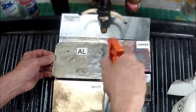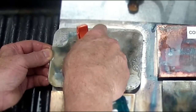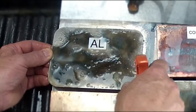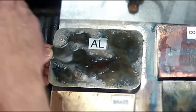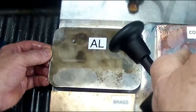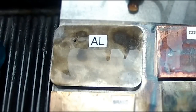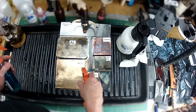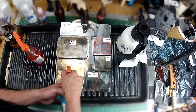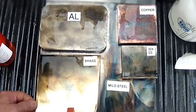What you see bubbling there is pretty unusual because the activator is not that acidic. What you're seeing is a release of hydrogen gas, and even though it's odorless, it's not safe. I wouldn't recommend using the activator on aluminum unless you've got a fume hood or you're working outside with a cross breeze — cutting aluminum with the plasma cutter is also dicey if not done correctly. None of the other metals gave me that hydrogen off-gassing like the aluminum did. Be warned — not recommended for aluminum.